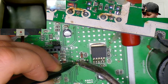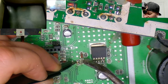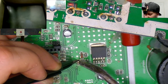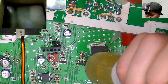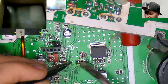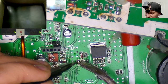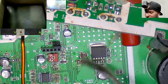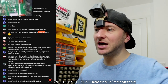If your 12 volt power supply is an old fashioned linear power supply that uses a transformer inside, then yes, you might actually see 18 volts on the power supply output when the supply is not really loaded that much. It's a little bit dangerous using these old fashioned linear transformer power supplies because the output voltage is not fixed, it's not regulated. So the supply is designed to be 12 volts or thereabouts when connected to the original appliance that power supply was designed for. And when you have it floating or connected to something else that draws a different amount of current, then it can actually output a wide range of different voltages depending on what it's connected to. So you need to be a bit careful with that.